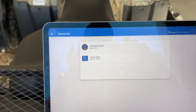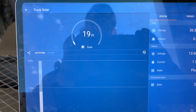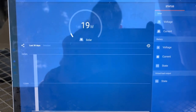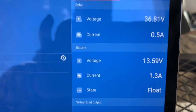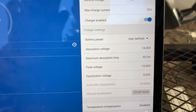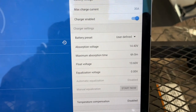Right now in partial sun - the beauty of the Victron Energy Bluetooth app - here's my truck solar, I'll bring that up. It'll connect. This app is fantastic. Right now I don't need a whole lot of power in my camper, my batteries are already topped off and I don't have loads going, but I'm still producing 19 watts. There are my voltage parameters set for lithium iron phosphate batteries. If I want to change on the fly I just hit the settings button and go to battery, then set my different parameters for lead acid, AGM, or whatever.